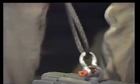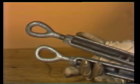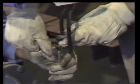Next comes the turnbuckles. They'll be used to adjust the lengths of the slings on the other end of the load. Shackles attach each turnbuckle to its eye bolt on the corner of the bed plate. The other ends of the turnbuckles are attached to wire rope slings. Again, shackles are used to make the connection. Shackle pins should always be tightened firmly, but hand tight is good enough. A wrench shouldn't be needed.